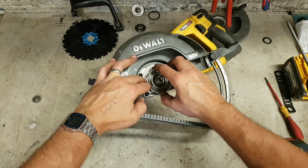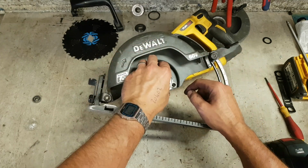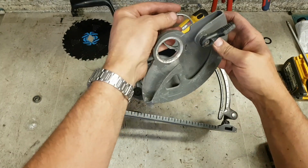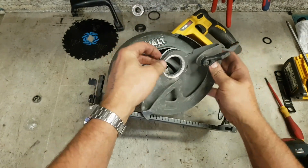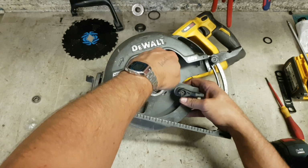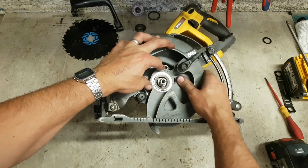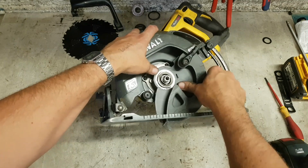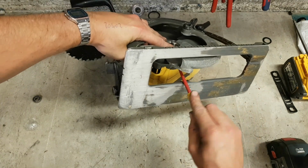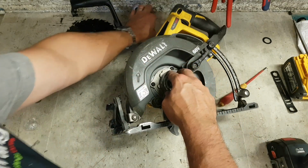Next one's your guard. Turn spring. The long bit pushes in there, in that hole. The actual guard, hooked part of the spring, hooks onto here. Hook that on. Push this onto the hole. You may have to just poke that spring a bit, get it centered, drop the guard down fully, which clears this track for the spring to go into, this ring spring.